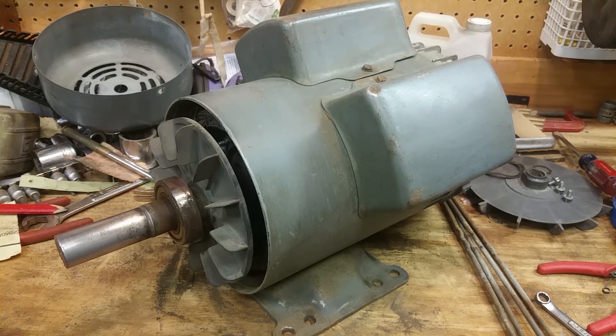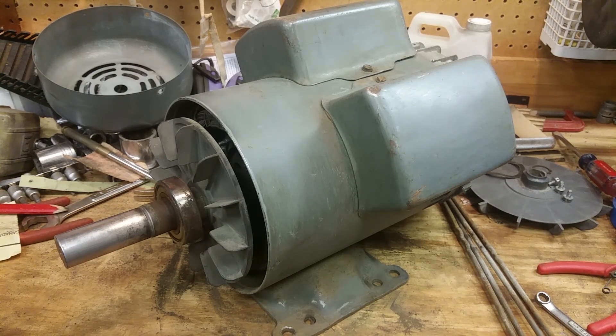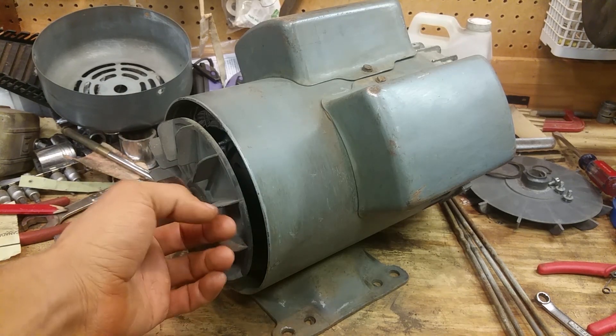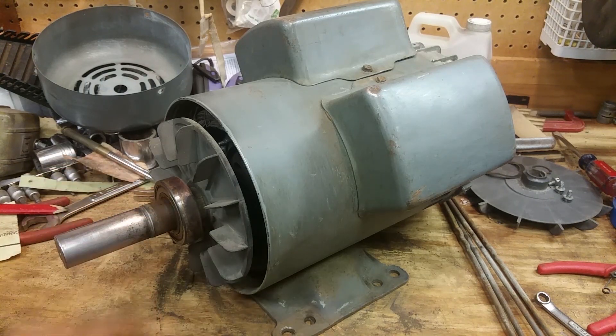It's worth rebuilding. It had a grumbling noise every time I turned the shaft and I thought it was a bearing. It was this bearing right here — it's failed. It had a little bit of water up in there against the case somehow and it failed. So I got a new bearing and we're going to replace the one in the back too while we're at it, because there's no sense in just doing one.